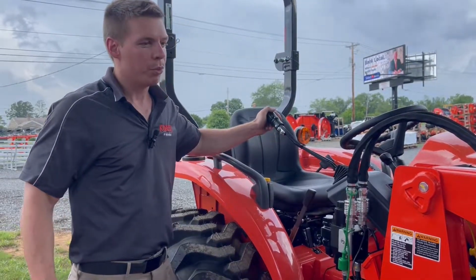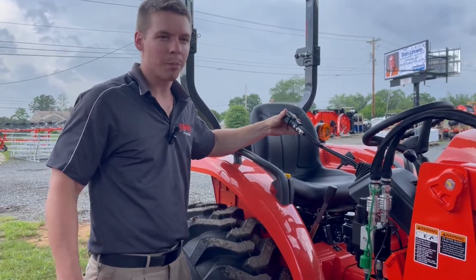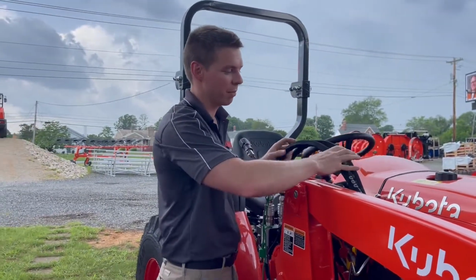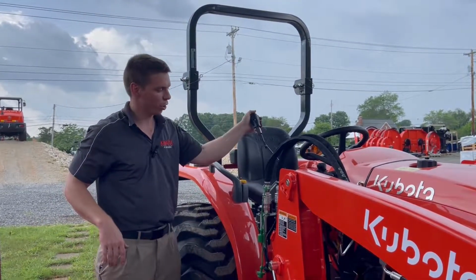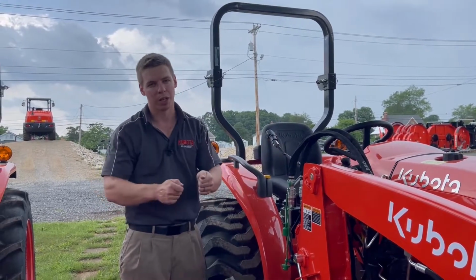And then move your loader around, move this all around, push your buttons on and off. And what you're doing is if it's under pressure, you'll see these hoses are tight. There's that pressure pushing against them. And it'll loosen all the pressure and you'll kind of see them droop down a little bit more. And you're really just going to work this loader all the way around and work your buttons all the way around until there's no more pressure on it. Then it'll plug right in.